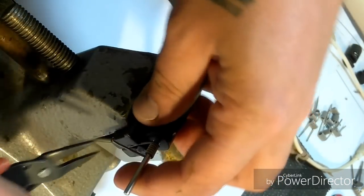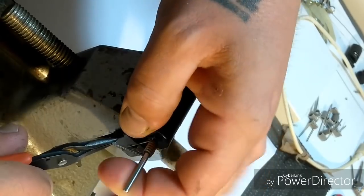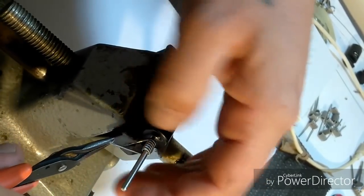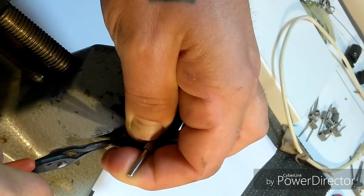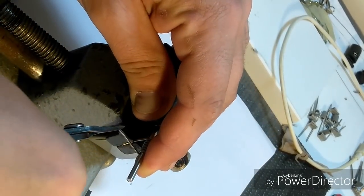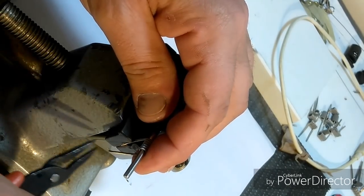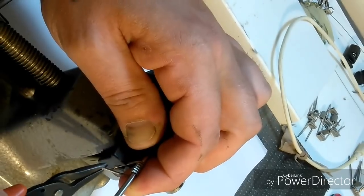One more thing I didn't show. To get this coil tight, I could pull with the needle noses down and pull this up, and it'll get that coil nice and tight. So basically the vise and the needle noses are pulling down while I'm pulling the wraps up.